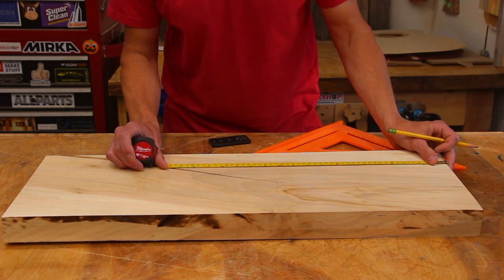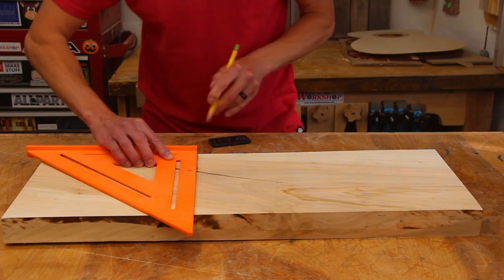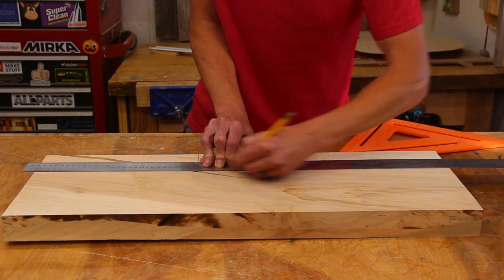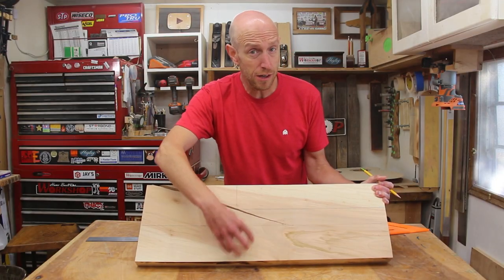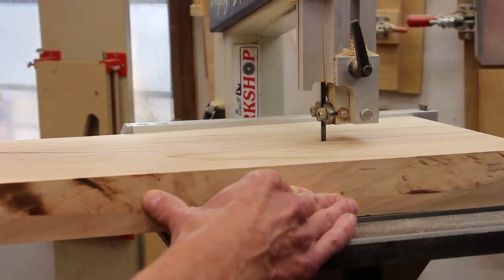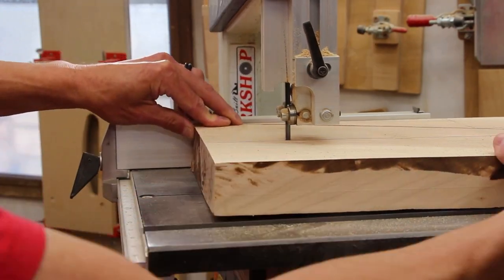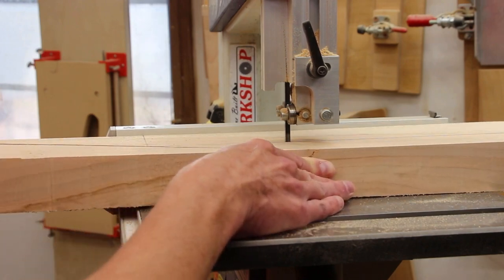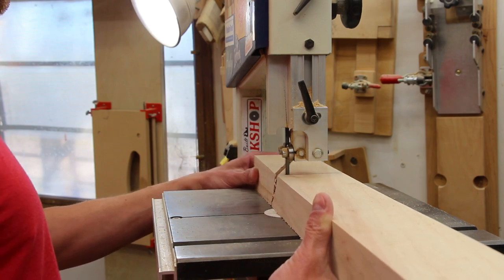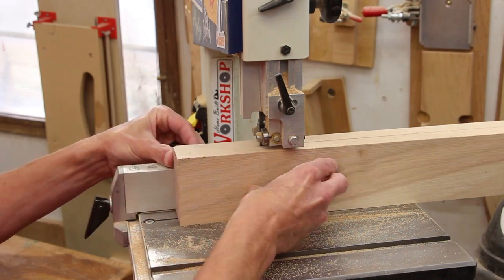This piece does have a nasty crack that I'm trying to work around, so I'm just going to take the first few minutes and lay out where I need to make my cuts, trying my best to avoid the crack. I think I can get some pieces down here from the base and up here we'll get the brackets that'll eventually hold the pipes. Another feature of this piece of wood is it does have a little bit of twist in it, so I'm going to use my band saw instead of the table saw to make the cuts. That way I don't risk getting any nasty kickback. The band saw is a little bit more tolerable to working with this twist. Just trying to be safe — keep your fingers.